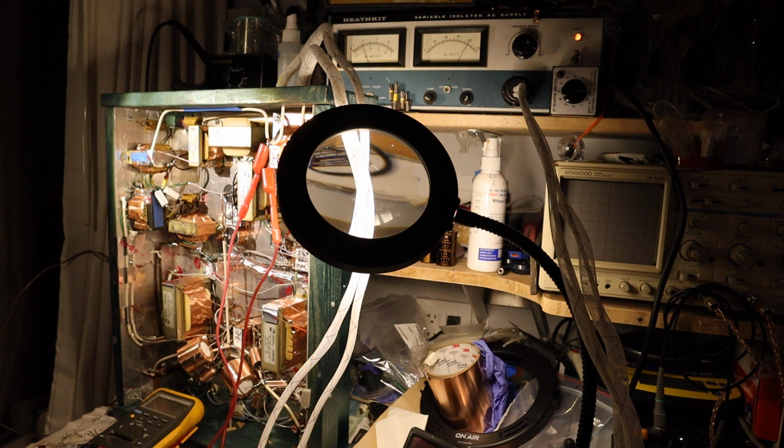So actually, if I wanted to, I could operate these NOS tubes in them, which are 8532. So that's the military version. It's rugged. It's designed to take abuse. So probably they would operate like 5 years like this, 10 years, easy peasy. But if you keep their voltages proper, then these input tubes will last longer than your lifetime. And also they will sound quite a bit better when their filaments are not being overcooked.